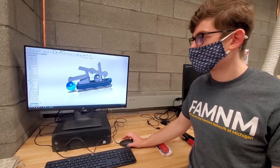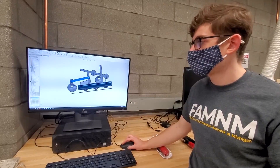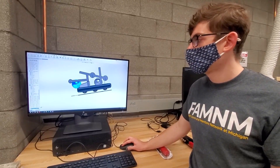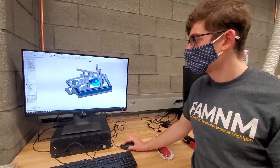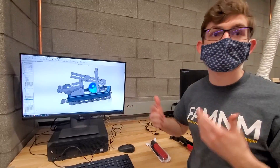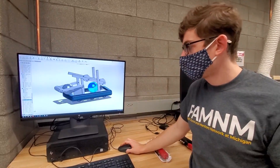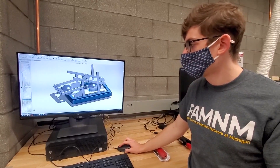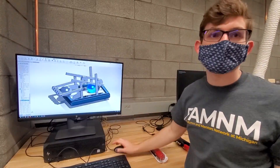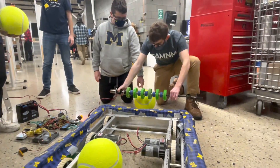The intake is going to be motorized along with the shooters, so the ball will be sucked in by the intake arm out here, grabbed by the wheels, pushed up over the bumper, and dropped down into the hopper, where it rolls into a holding position. We have a cutout to hold the ball there until we want to shoot. We then spool up the shooter wheels, and a camshaft connected to a servo will squeeze the ball up into the shooter, where it will fly out at high speed.